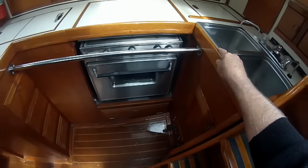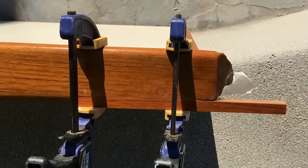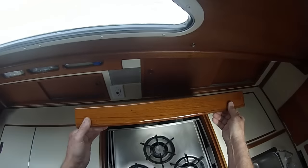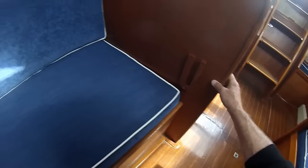All these old boats have their wonderful teak interiors marred by dings and kicks and the dropped hammer now and again. It's pretty easy to fix — you just clamp on some old piece of teak, plane it down. I think the wood doesn't matter so much as just restoring the original profile.